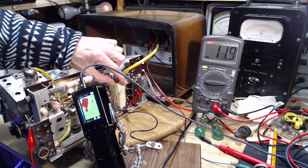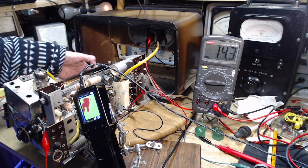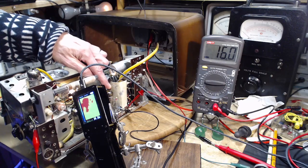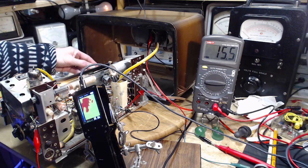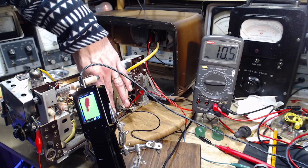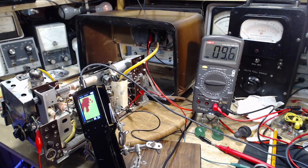Jeepers. Sounds like the radio's still working. Let me tune it here. It's definitely picking stuff up. It's still noisy when I turn the volume down, so the noise is coming after the volume control. Yeah, it's just these two guys. My gosh. Okay, lots of red on here now. Some of it's going to be these other two. Oops. Oh, listen to this radio. Oh, holy smokes.